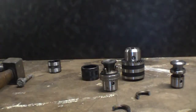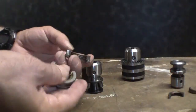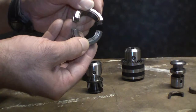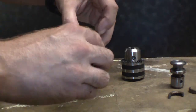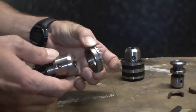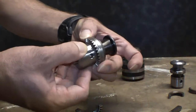When I took this apart before, one of the first things that's going to happen is that those are gonna fall off, and it might freak you out a little bit — but that's intentional. You can see that these fit together perfectly, and there are notches in here so that it encourages a break along there. If this ring was not broken, you would not be able to install it either from the top or from the back — you would not be able to slide it in. So it is broken and then it can fit over the jaws and engage in there with the threads and that whole thing. Moral of the story is that's going to be okay.